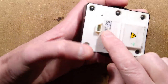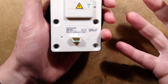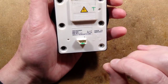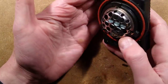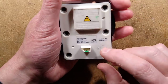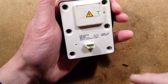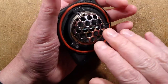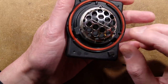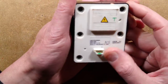There is a three-pin connector on the back. One of them is the ground, as you'd expect. One of them is 12 volts, and the other is a pulse-width modulation input that, depending on the mark-space ratio, will determine the output of the unit. It can also drag that input down to signal back to the control system that there's a fault. It can detect temporary problems like water getting in, and more terminal problems such as persistent arcing. So there's a bit of intelligent stuff in this.